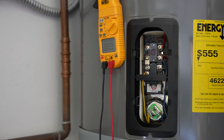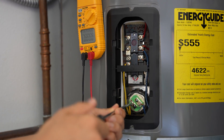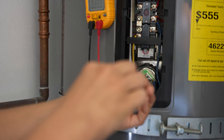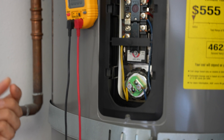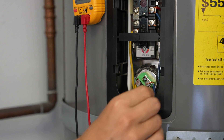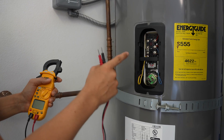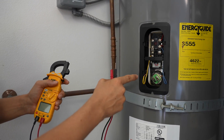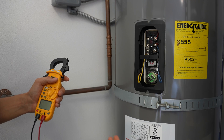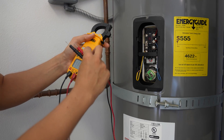Now that I've verified the power is off, I can proceed to check the resistance on my heating element. Simply loosen the screws holding the wires and pull those wires out. Some people say you can check it without taking the wires off, but that can give you a false reading. The right way to check resistance is to take the wires off and then check the element. You do not need to drain the water heater when testing. If the element is bad, you'll get a really funky reading, an OL, or some super high reading — it'll be pretty obvious.